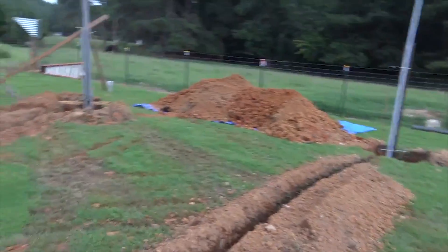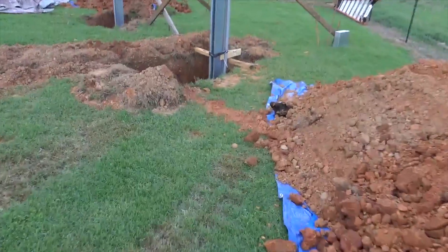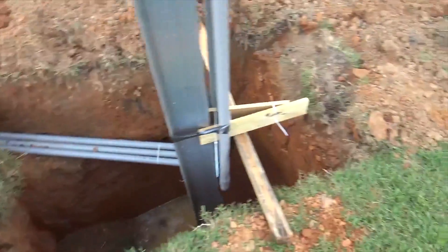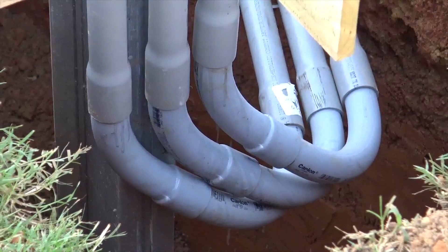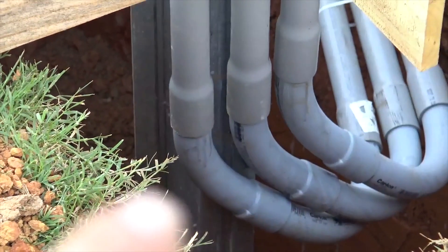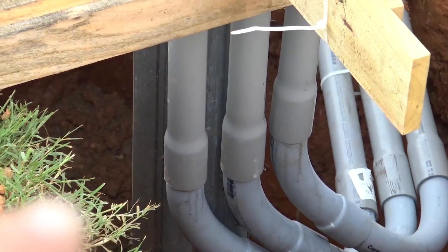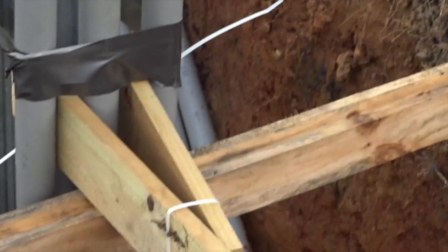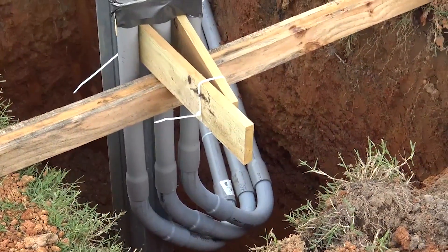Our usual Schletter mount — we didn't use an auger; the track hoe on site had a big bucket so we dug the usual swimming pools and they're filling up already. We've got three conduit lines: the left one feeds the solar we're building now, the second is a home run for future solar, and the third gets over to the other array. For now we're running two home runs, about 175 feet to the solar.